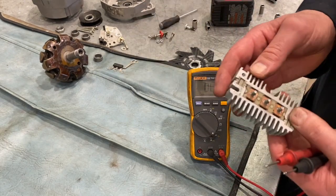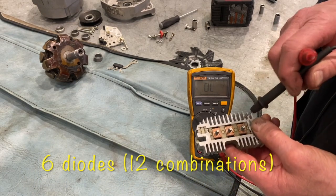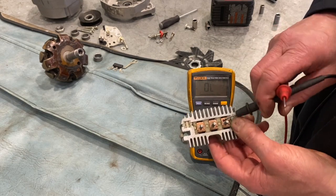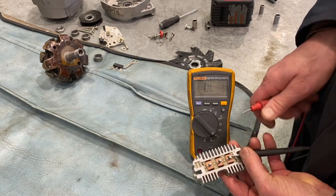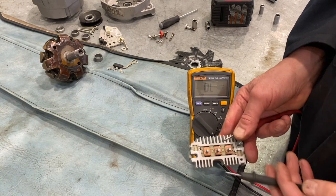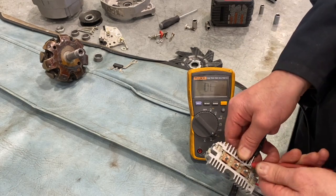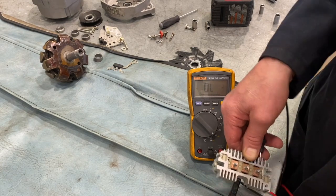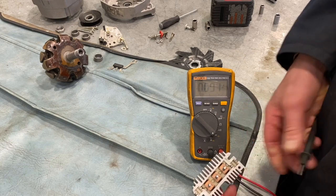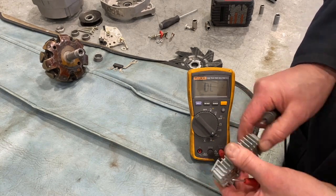We can also test the rectifier bridge — those six diodes internally. There's a little strap on every diode that goes internally onto a diode. The diode spans from here to here, so you can see that little gap where the diode sits. When we test these by touching the terminals, we should see continuity one direction. All those diodes are showing continuity that way. If I reverse the probes through the diode, it should show out of limit on all those diodes in that direction. We'll also do the other half — check for continuity traveling one way through that set of diodes but not the other. So we can confirm that all six diodes in this rectifier bridge are in good shape.